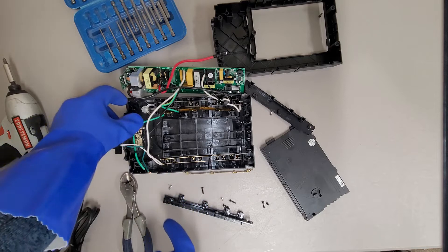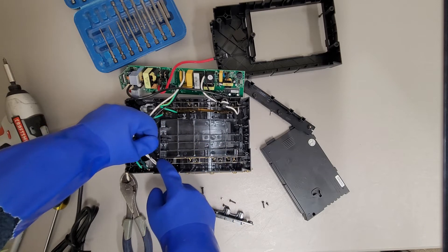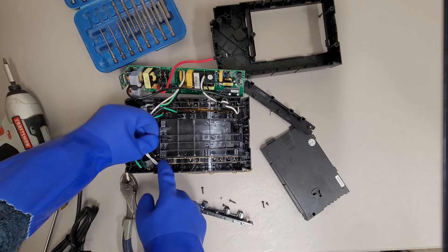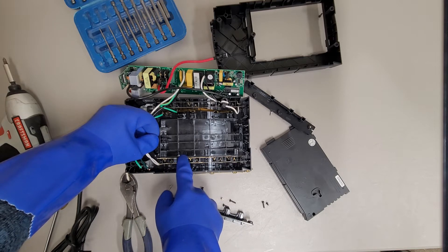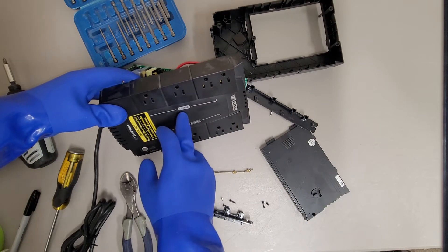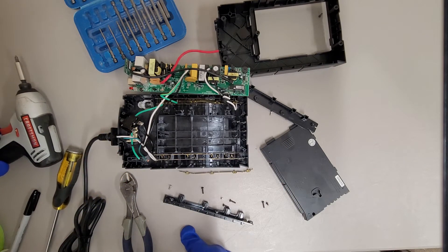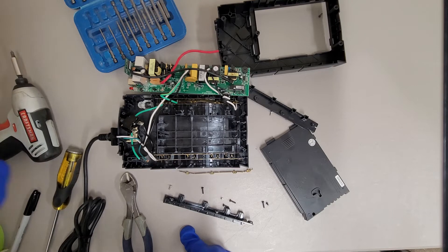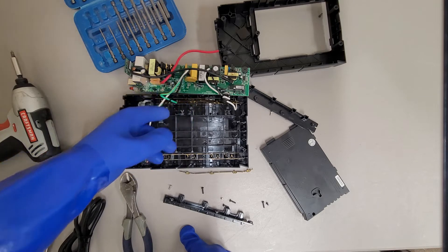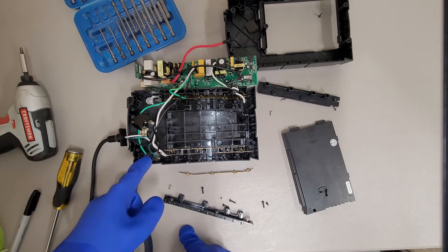This is the feed going through the fuse, and these two wires were soldered to this bus bar — which is the hot side of the outlet. This would be the non-battery-protected side, which is funny because they label it as surge protected. I don't understand where the surge protection is. Unless a power surge goes through here and into there and the stuff inside stops it — but I don't think that's how things work. It's path of least resistance as far as I know.